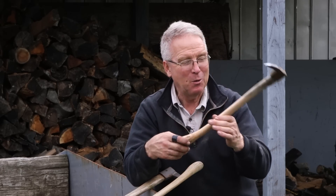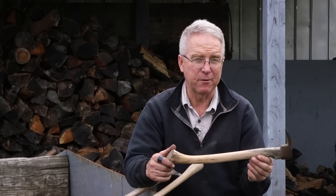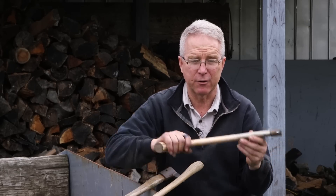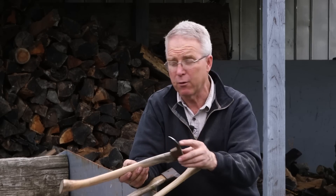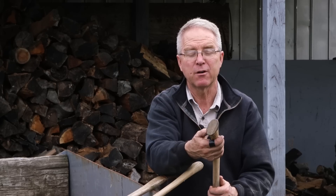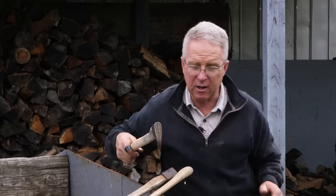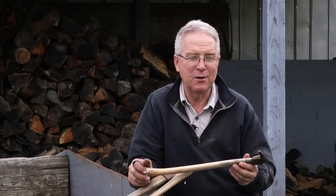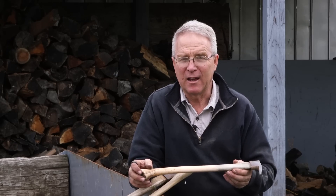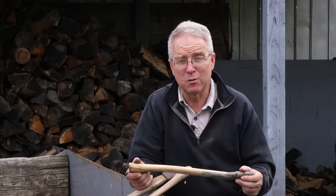This little beauty — probably the pick of the litter — illustrates all these things beautifully. It must have been made for a carpenter shop application, maybe a chair factory where somebody is pulling small pieces off a conveyor belt. It's actually been split and hand-forged, and the handle was handmade — there are two little laminations on the side to make that bulb really big. If you're squeezing your hand at all, you're just not coming off the end of that. The upshot is the old-timers knew how to make the tools that made their work efficient, and if you're moving much wood at all, unless you like to bend over and pick things up, you really ought to think about getting your hands on a pickaroon.